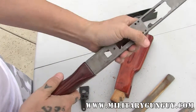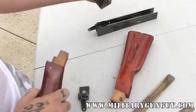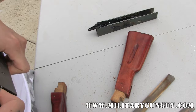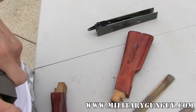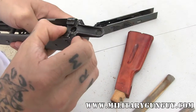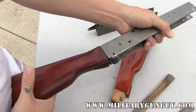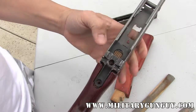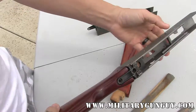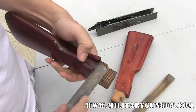Okay, not too bad. Looks good overall. Probably need to clean this area up a little bit, clean that area up a little bit. Then you do another test fit with your trunnion installed in your receiver. If you want to stick a rivet in there just to kind of help hold the trunnion in place while you set everything up, you can do that — that's a good way of doing it. You can see that with the trunnion installed, even without the rivet, it's not fitting quite as well as we would like, so we're going to pull this and keep fitting it. I'll get a little off the top.